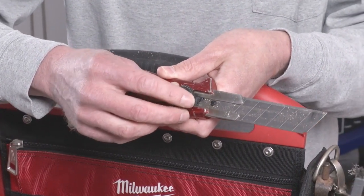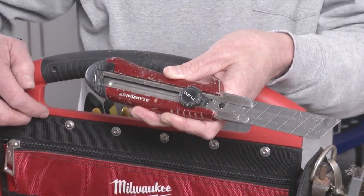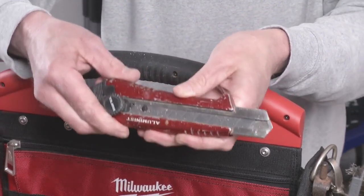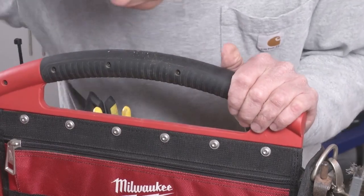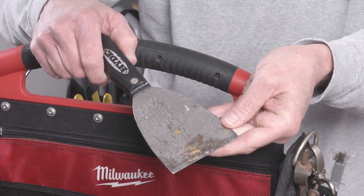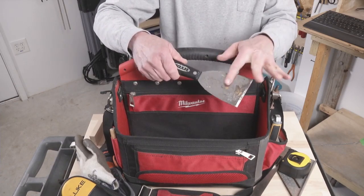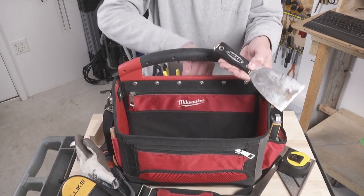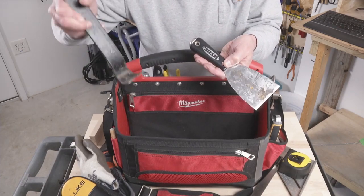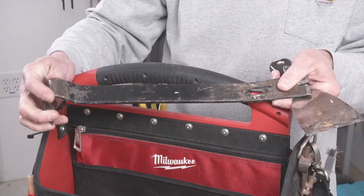What's special about this one is that you can use it to cut thick rigid insulation materials because of the snap-off blade. This is made by Tajima — it's the Rock Hard series. Super good tools. I've had this for years. Stiff putty knife — I only use this to remove moldings, baseboard, separate shoe mold from baseboard, and pry off casing. It's a great thing to slip behind the molding and then you can use a flat bar to pry on this so you don't mar the wall or the floor. You've got to have a flat bar in your tool kit — it's supremely useful.